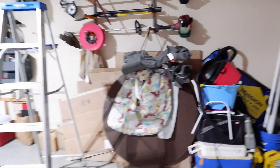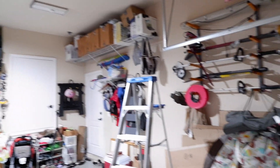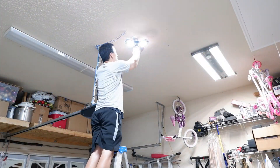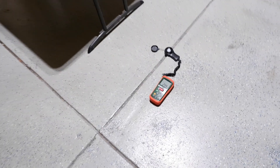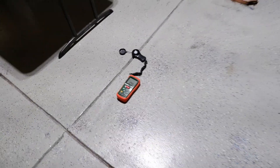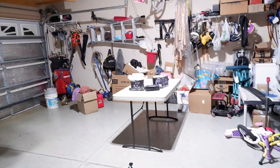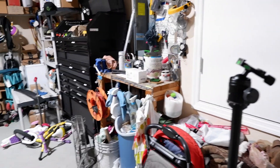You can just see the brightness in the rest of the garage — it's pretty acceptable depending on what you're coming from. If you adjust those paddles you'll get much better light on the outsides. So let me adjust those paddles and see how we can distribute that light. Now that we adjusted it, we actually lost some of the direct light here — we're down to about 24.2, 24.3 foot candles. But that's because the light is now distributed out to the walls, lighting up the bench area, the work area, and back here, giving much better distribution of light around the actual garage and all the places you might be doing work.